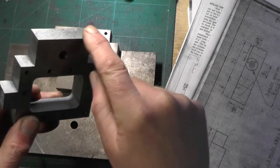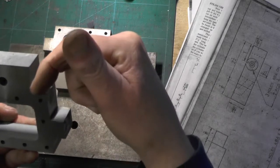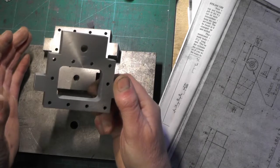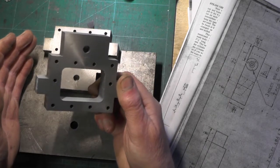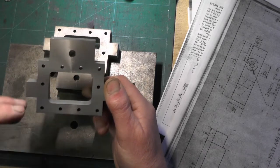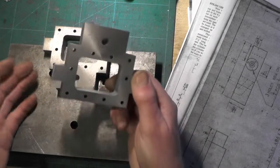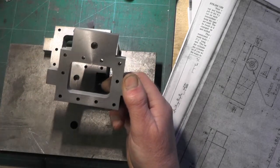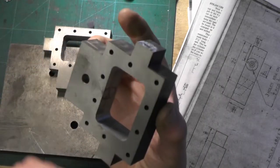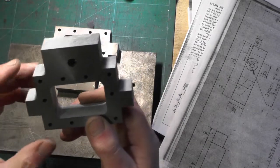I've cut the profile on my milling machine - I actually hacksaw most of it first and then trimmed it up on my miller. If you haven't got a milling machine, remember you don't need one to do this loco. You can do it in a lathe with a milling attachment - a vice on a vertical slide. It's the same really, just working horizontally instead of vertically. So I've faced these valve chests up to thickness and profiled the shape to the relevant size.